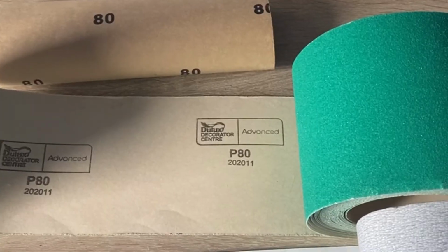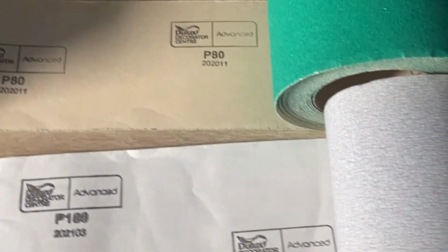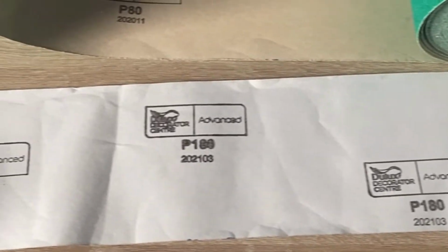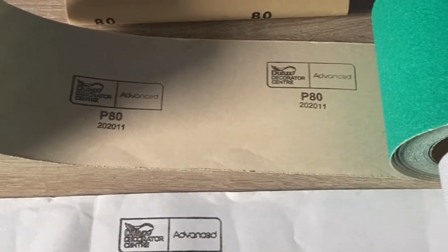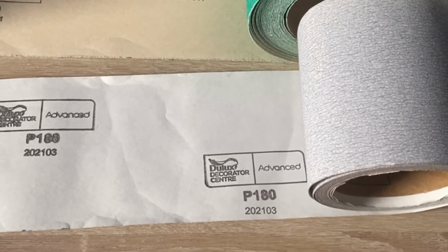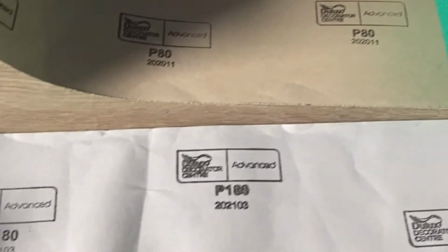But I've taken my time when using the 80 grit sandpaper because it's a low grit sandpaper. It may show noticeable scratches or swells on the wall, okay? So I've used it to smooth the surface when sanding, because any imperfections not addressed before the patching and painting process will be visible after.